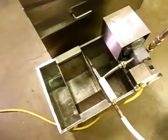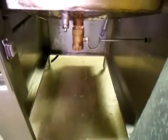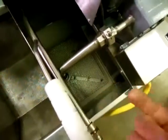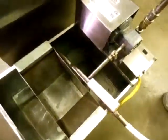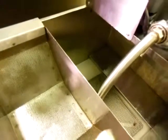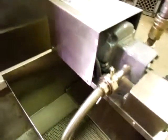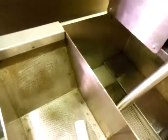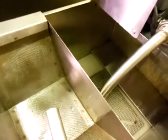We'll turn this on. This is the pump, obviously, right here. It goes right down inside here — this is the pump garage. You drain your oil down from the drain right here into the pump, and it will go through the filter, which is right down here. It also goes through this screen first to catch the big chunks, then goes down into the filter, and the pump pumps it back around. Of course you know all this — you've fried donuts before — but I just want you to know how well this works. We've got mineral oil in there. That's very important: if anybody tries to demonstrate one of these pumping water through it, well, it looks good, but in a week or so this pump is going to get all rusty and bound up and not work. You don't want to run water through these and let water sit in the pump — they're not made for water, they're made for oil. So we run mineral oil through it, and that'll keep everything nice and shiny and clean on the inside while it's in our warehouse.